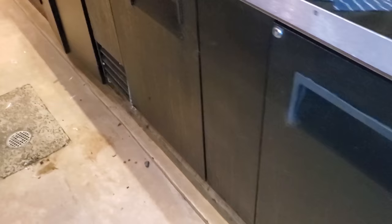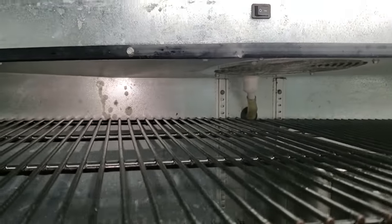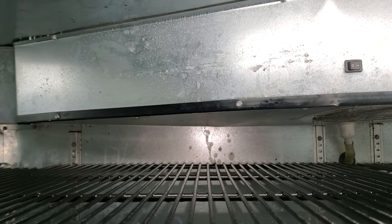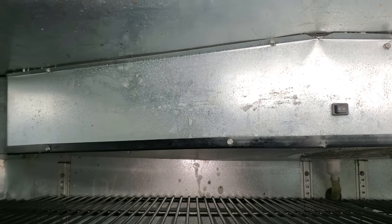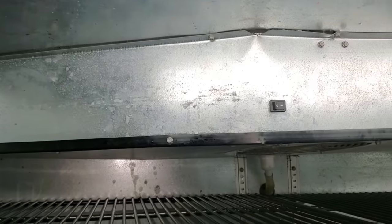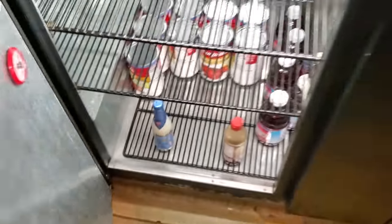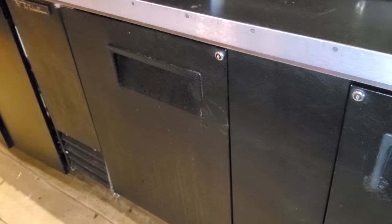It's a little difficult to show, but what I actually did was shut the unit off and ran my leak detector in here. I was picking up a trace of a leak in the evaporator too — very common on these things. So with that being said, we're going to submit a proposal to change the condensing unit, run a new capillary tube and accumulator, and put in a new evaporator coil. We'll see if that's something the customer wants to do. I would highly suggest they change this box, but that's their decision to make.